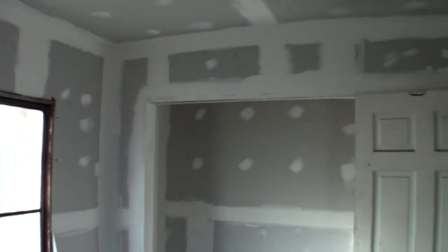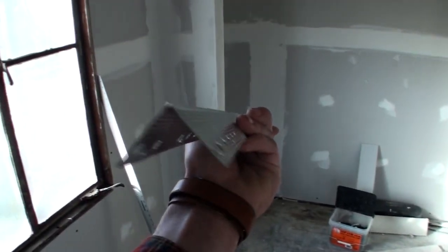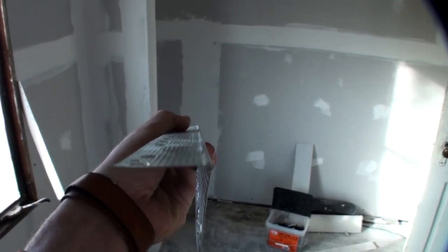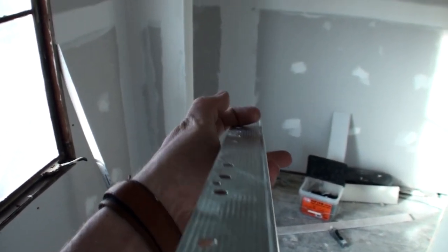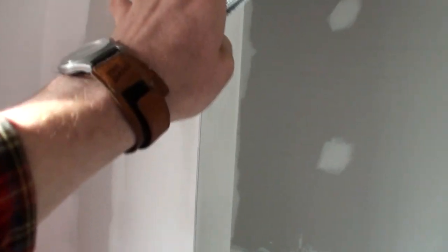Everything else is pretty straightforward. I'm very happy with the way it's all gone so far, except for how slow it is — but that's just working on houses in general unless you've got piles of money for laborers. This closet has corner bead the same as the laundry room. Corner bead is a lightweight metal piece with an actual bead on the edge. Once you apply joint compound, your knife slides along that high spot and it's feathered back into the wall. I'll lightly sand them to knock down any high spots and then come over them a second time, which should be enough.